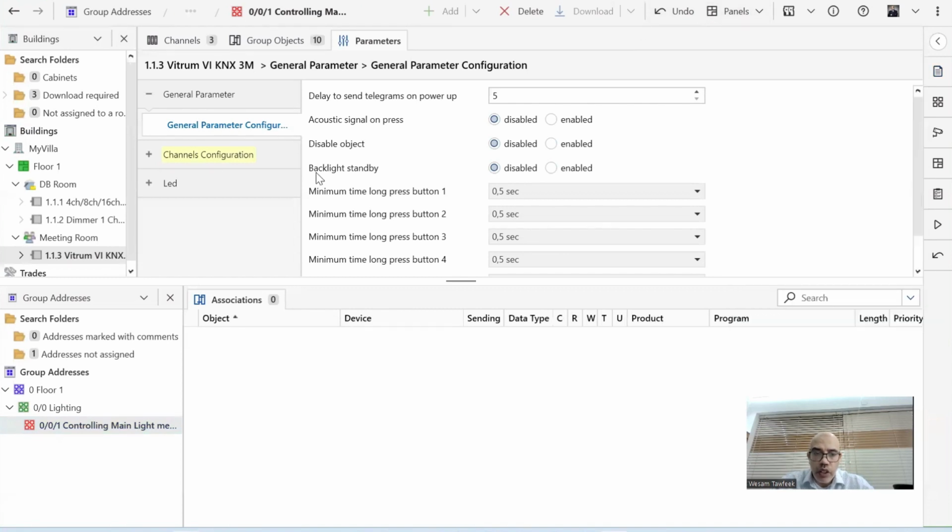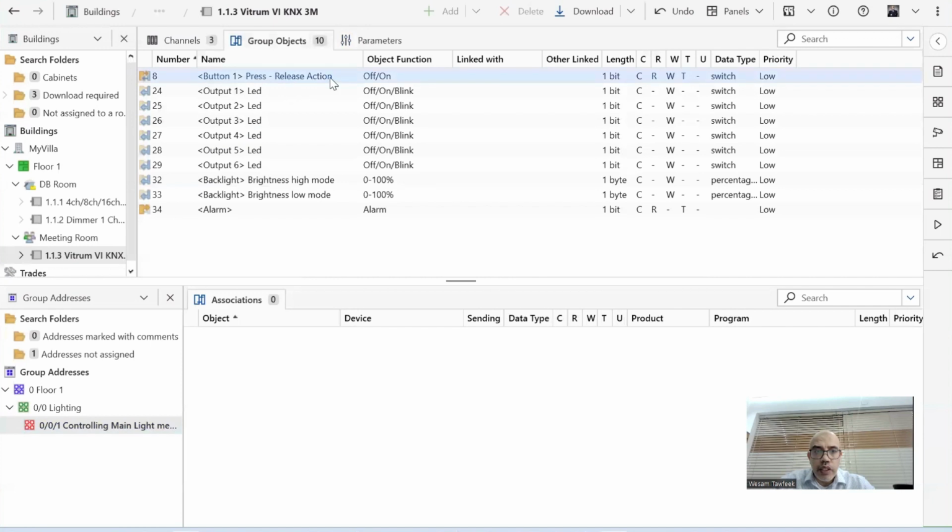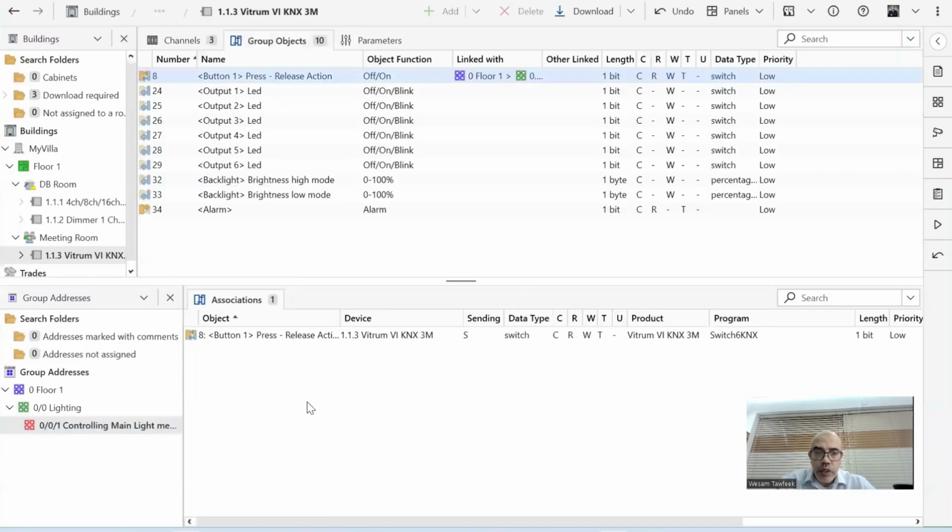Okay. Good. In this group address, I need to put the 2 devices that will talk together. In my case, I want to put the keypad. So I go here, see the group objects in here. I'm already choosing the keypad. Put group objects. I want this button, when pressed, to send a data to the relay. So I drag this one and drop it. Now it is already in the group address. I want this one, this button, to send the data to what?